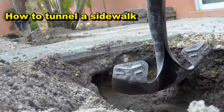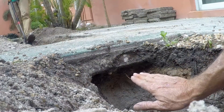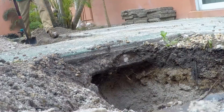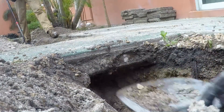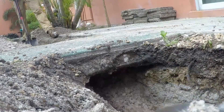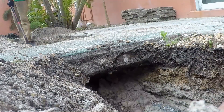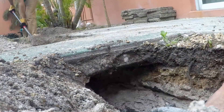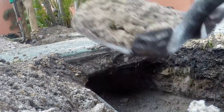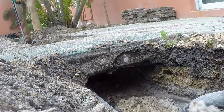Tunneling under a sidewalk is real simple to do, especially in sand. The best way is to dig a trench to the sidewalk so you can get your shovel down in there. The secret is to scrape at the top of the concrete, scrape it to the top, pull it down, then pull it out — comes out pretty quick. We also have a power line right here but it's not really in the way. It's the same even if it's clay — works exactly the same. Remember to scrape at the top.